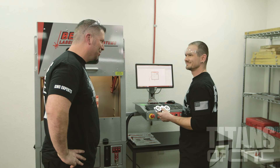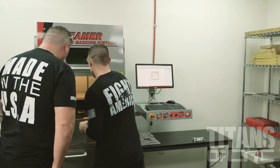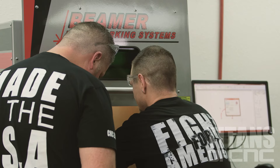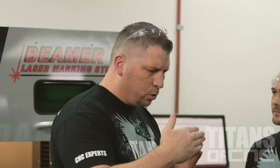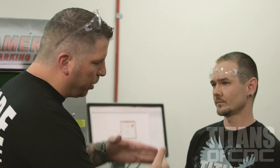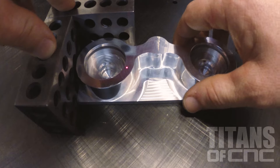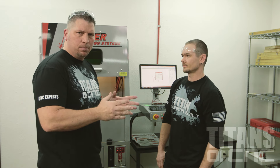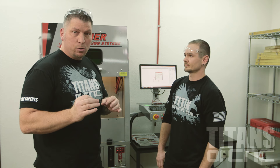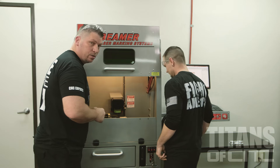It'll project in red, just like the letters. So we have our fixture in there — just two one-two-three blocks. This allows for consistent fixturing. He puts one block here, one block there, creates a stop, and just places the part right in. We're using one-two-three blocks today, but if this is a repetitive part you probably want something a little heavier so you can move the material quickly. There's no pressure on the part — you just make sure it repeats and goes in place perfectly tight.